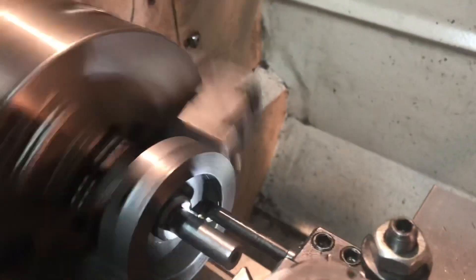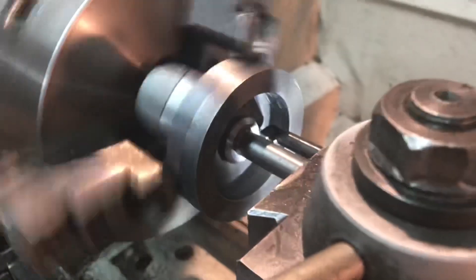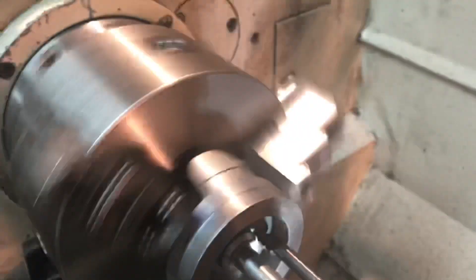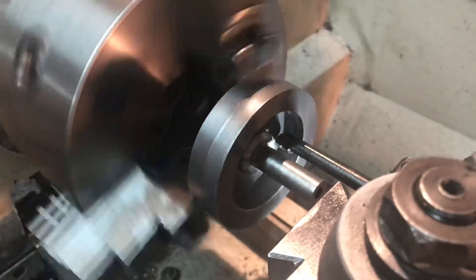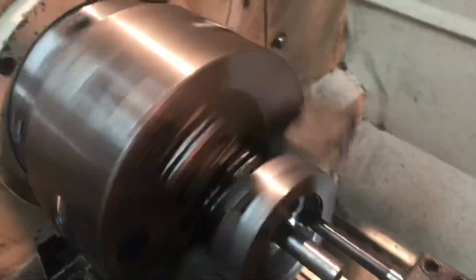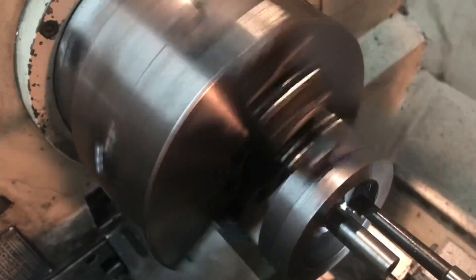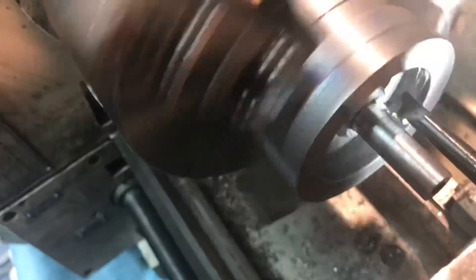I'm so happy I got the lathe running again in reverse. I've finished cutting the stem down to the half inch and I'm starting to cut the cone shape on the inside. Remember, I'm using cast steel, and it is a lot tougher than the gun metal kind of part that Matty was using. I'm indebted to Matty for coming up with this technique. I'm using a boring bar set that should clear, and I'm actually finding it's cutting really good in reverse. I'm drawing the cutting tool towards me, and you can start to see the cone starting to appear here.